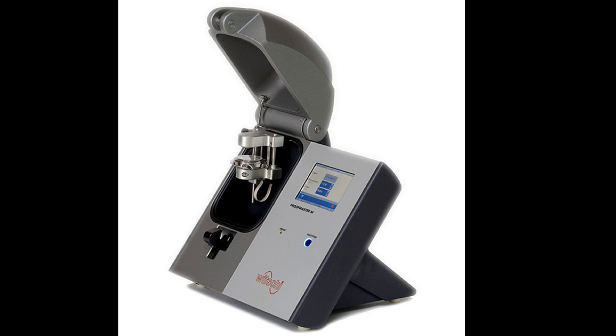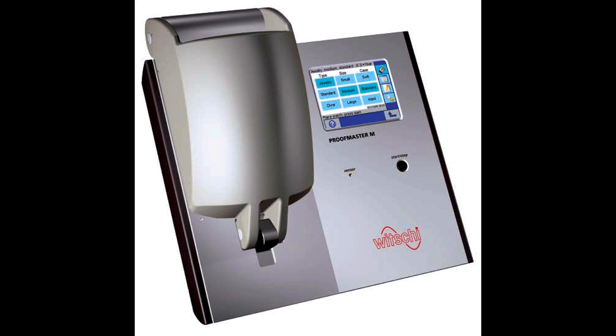The cover of this equipment is sealed and the test can do one of two things: it can pull pressure out or add pressure in. When it pulls pressure out to about a third of an atmosphere or four or five PSI, and assuming the watch is sealed, evacuating air around it means the air inside the watch wants to expand. Believe it or not, the crystal will bow out very microscopically, but this probe will pick it up. If the watch is leaking, some of the air will rush out, it'll come into equilibrium with its surroundings, and the probe will move — measuring the leak.